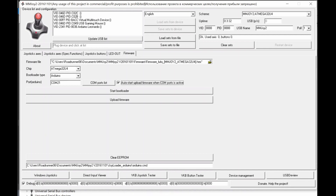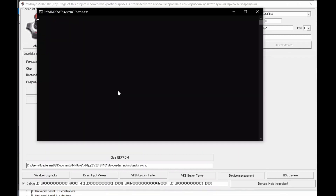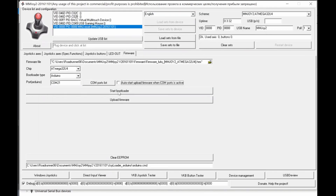Keep the hex file and parameters the same — ATmega32u4 and Arduino bootloader type. Note: if you shut down your computer and reopen, you'll need to re-select the hex file and re-check all parameters. With the COM port set to 21 and the checkbox ticked, press the reset button on the Arduino Leonardo and it will start uploading the firmware. Once done, the same VID and PID will appear as before since we haven't changed them — meaning the Leo and Pro Micro will have conflicting IDs if attached simultaneously. You must assign different PIDs to each device.